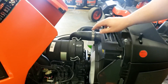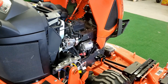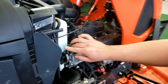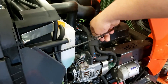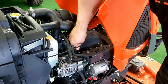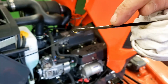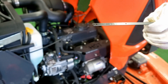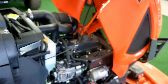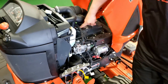Your coolant, your air cleaner, this is your first fuel filter. On this side right here, this is going to be your coolant. Your level should be in between those two lines. This is your engine oil dipstick. You will pull this out, wipe it off, reinstall, pull it out again, and the level you see should not be above that top line. It should definitely be in between — we always recommend getting close to the top but don't overfill. The fill for your engine is right here on top.